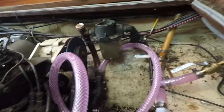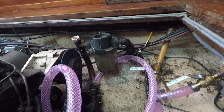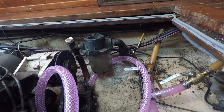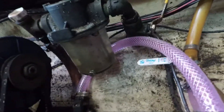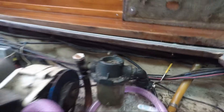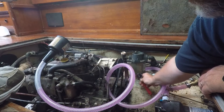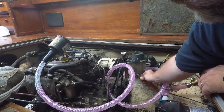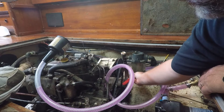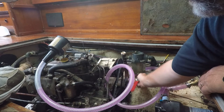You can see we've got the antifreeze in the new temporary inlet hose. Now I'm going to attempt to drain the sea strainer so it doesn't bust during the winter. You can see the bolt right there to drain it. If we lived in the Caribbean we wouldn't have to do that — we're working on it! This drain bolt right here probably hasn't been moved in three years. The prior owner didn't come to the boat for three years, so none of this ever got winterized. Thankfully it never ruptured.